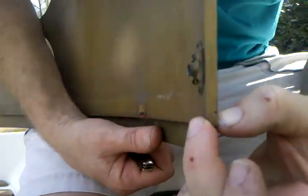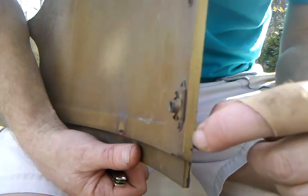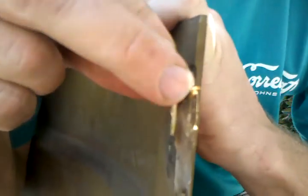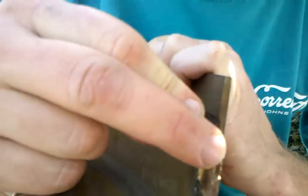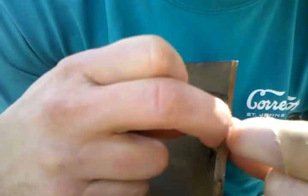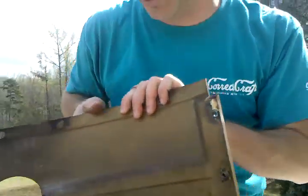And that's the difference. On the other side of this panel, you can see how thick it is — about a quarter of an inch thick, and it's nothing but fiberglass layers, layer upon layer of fiberglass. If we scan and move up towards the top, what a delamination is, is the plies of fiberglass coming unglued from one another and starting to separate — they are delaminating from one another. That's what a delam is. The terminology is often used interchangeably, but there is technically a difference.